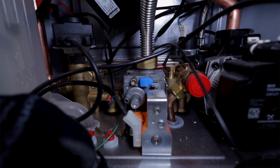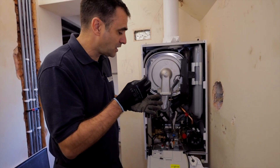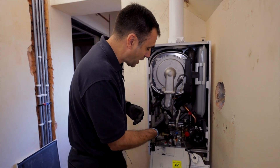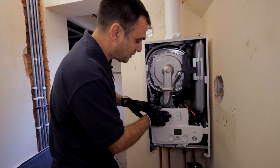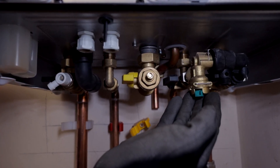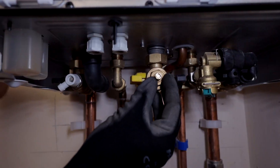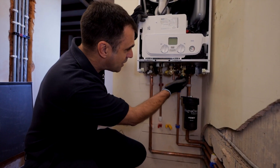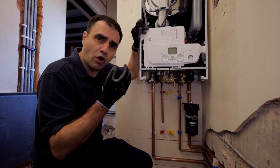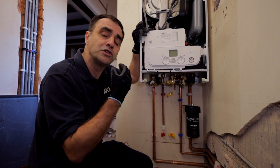Moving further down, all the hydraulics are brass — tried and tested. We've taken our existing hydraulic set and made it a little bit smaller so it fits into a smaller space, but we know it's reliable. Underneath the boiler I've got all my connections: cold mains, flow and return, hot out, and gas. There's a test point on the gas connection making it very easy to check inlet working pressure, and of course there's the Baxi Easyfill. All connections are 22 or 15 mil compression, so you can use the connections that come in the box or your own pipework.